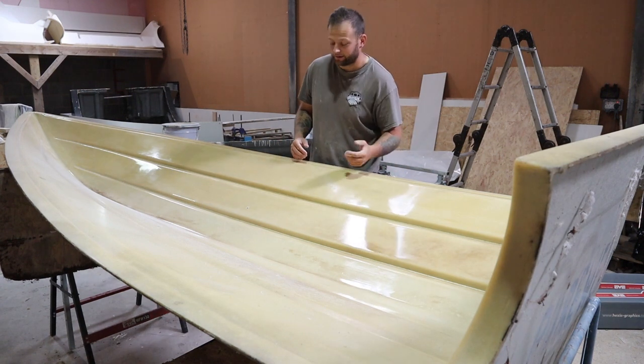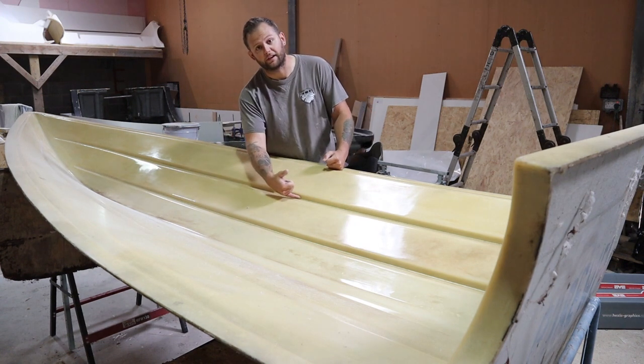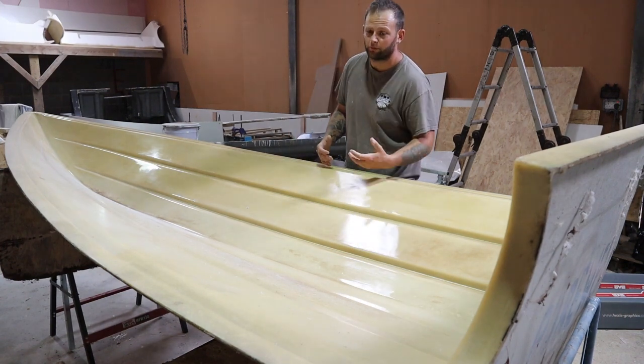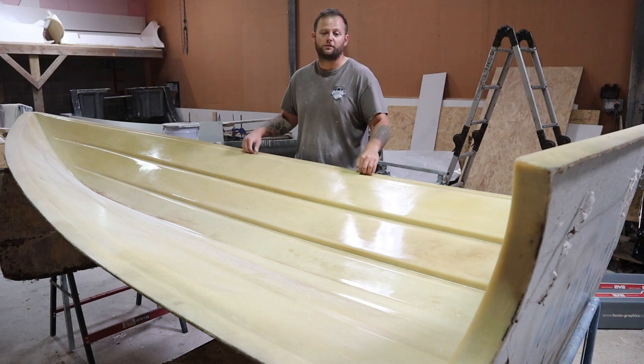Sometimes we'll get a clean rag and then go into these deep little pockets and shards, because this is where the compound's going to collect. And then obviously at the end of the day, if it stays in there, you wax over the top of it and pull the component out of the mould, it will stick into it. Okay, so just make sure you're nice and thorough anyway.